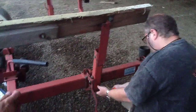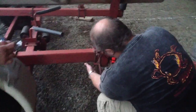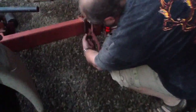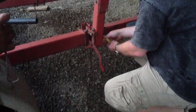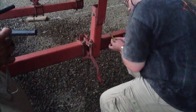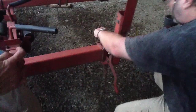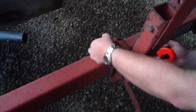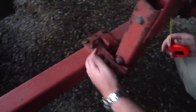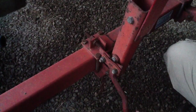Now the height, from the bottom, there's a pivot that's been welded on here, as well as an L bracket. Oh, this is maybe a plate. Looks like it's got a plate going across the whole bottom here. Then there's another side piece welded on here that's not very tall. It's only about 1 3/4 or so. And then he's got 4 bolts with a top plate to put this whole assembly together. Another piece of angle iron with an adjustable nut and bolt with a couple nuts on it. And that allows this whole contraption to be adjusted for how far this goes out and in.